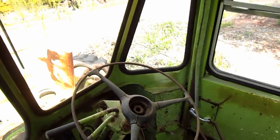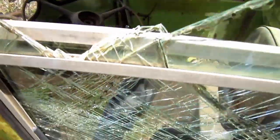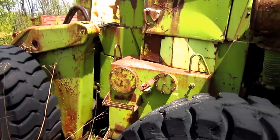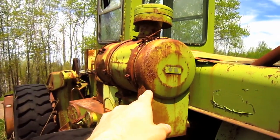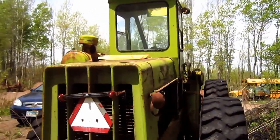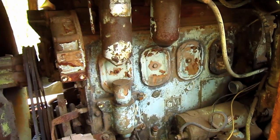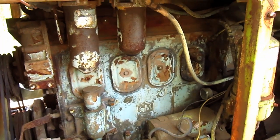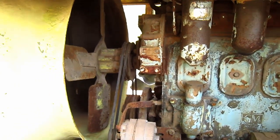From right here, you can get a crystal clear view of what the operator would see running an L30. On the right side of this loader, here you can see the single air intake and air cleaner for the engine. The L30 is powered by a Detroit 471 inline four-cylinder diesel engine that develops 144 flywheel horsepower, which you can see looking right under the hood here. The engine in turn drives the hydraulic pump and the Allison Torquematic transmission.